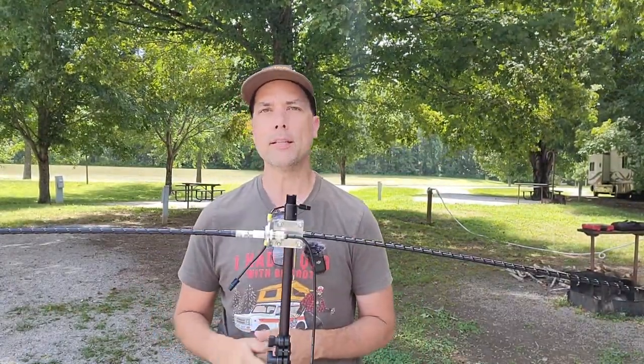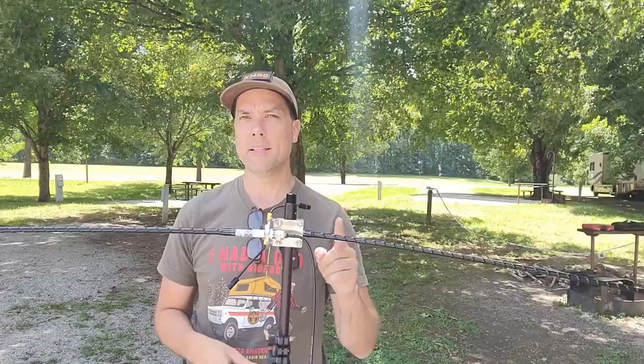If you already have the hamsticks, this would be great. There are also a variety of different ways you can get this dipole up in the air. You do not need to use the Buddipole tripod and mast system — you can use any tripod and mast system, or even no tripod, but you probably need some kind of pole. One of the really popular options is chain link top rail fence. Another option that might work well is a roof mount tripod for old school TV Yagis. I will leave links for those in the description. You'll probably find those at one of your local big box stores.